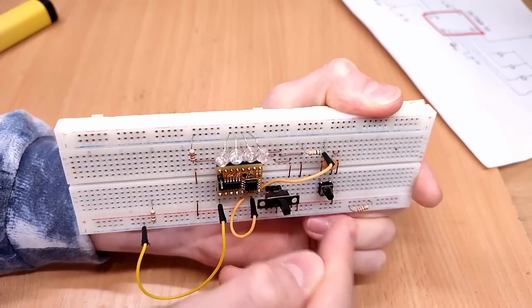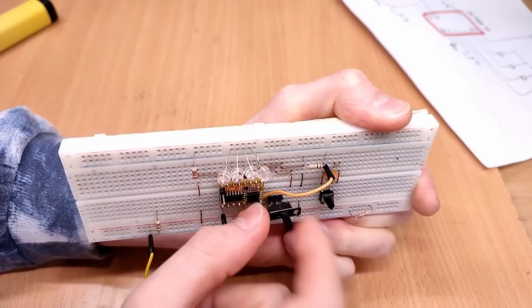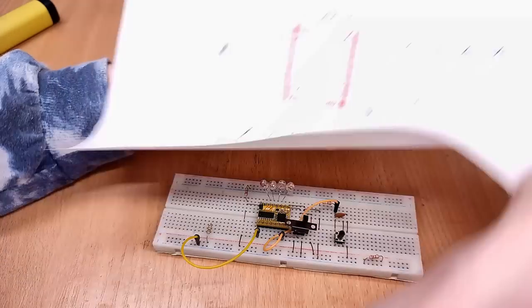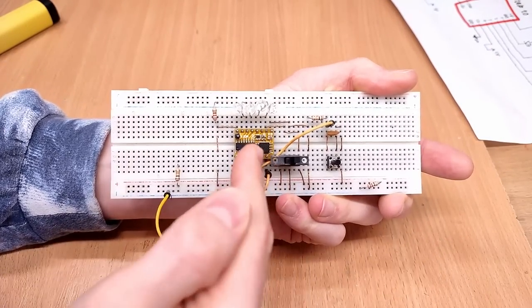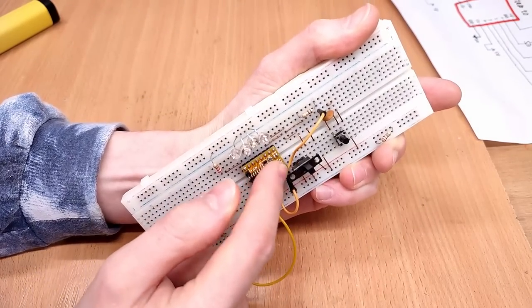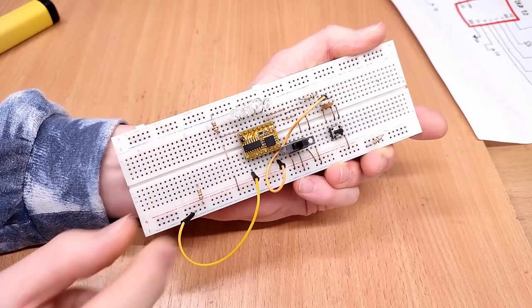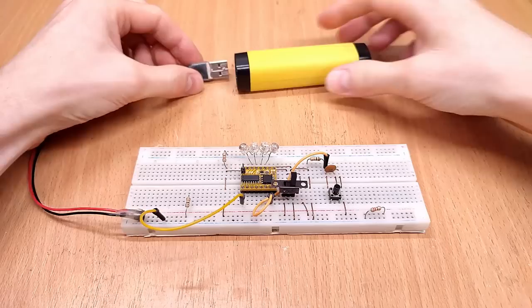Not exactly a lot of components. To test it, I'm going to simulate the step signal with a push button, the high or low direction signal with a toggle switch, and the step output with LEDs. That way I can step through slowly and observe if the sequence is correct. The most likely thing to go wrong here is the order of the sequence being incorrect due to software pin assignments not matching this latest version of my PCB.